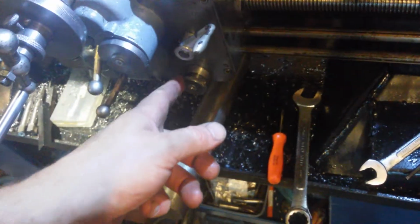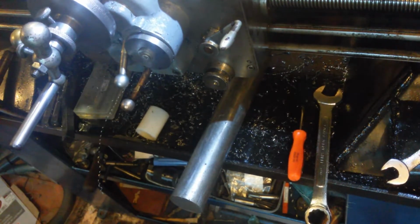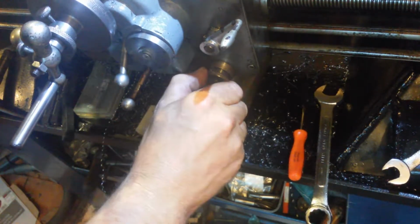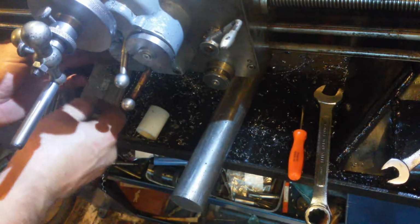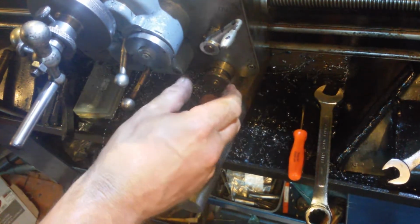And at the back of it, this is the micrometer adjustment for it. Bring the light back into where it needs to be. It's over enough. There's not much travel on this, but I'm sure there's 200 thousandths on it. I'll push it out to its full length. Yeah. Bring it back round to zero. Bring the backlash out. Bring it round to zero. Should be there. Put the stop up against it. Tighten it up. And again, we'll try it again.